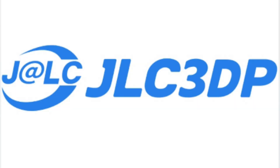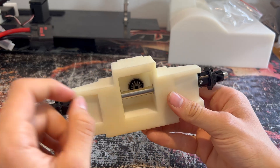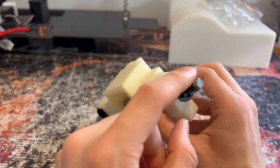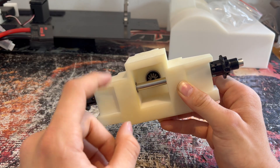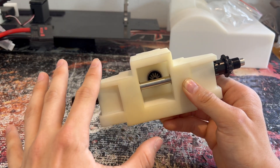A massive thank you to JLC 3DP for sponsoring this video — there'll be a link in the description. As well as super high quality materials, we're also going to be using an 8mm shaft to replace the 5mm one. The reason being is that these hexes have an 8mm bore, and before, using the 5mm shaft it was tricky trying to find and make sleeves, and then the wheels were all wobbly and slipped off.